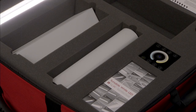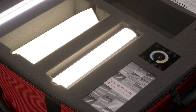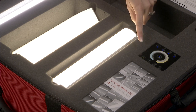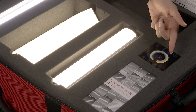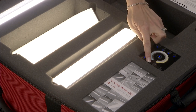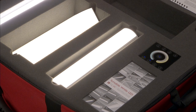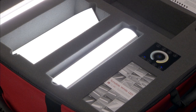Next, push and hold the center power button on the controller. The Lightplane Three Round and Noventa luminaires will power on. Now you are ready to tune their color temperature. Start by pressing the CT button on the controller. Then select one of the three standard presets by pressing the Scene 1, Scene 2, or Scene 3 button. Scene 1 sets the light to a warm 3000 Kelvin. Scene 2 cools the light to a mid-range value of 3500 Kelvin. Scene 3 cools the light output further to 4000 Kelvin.